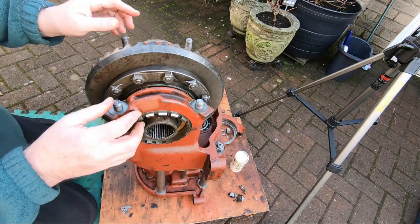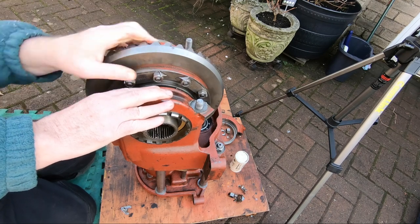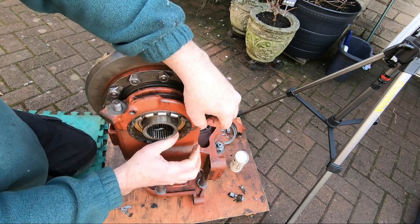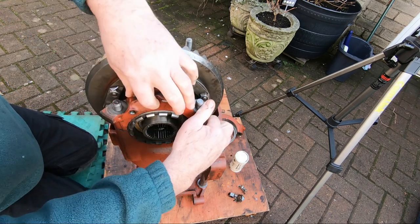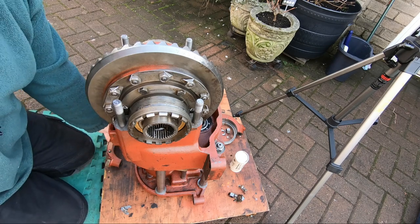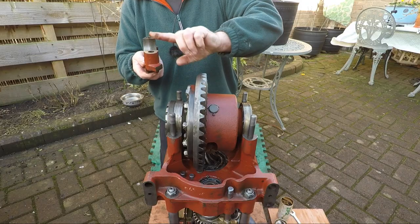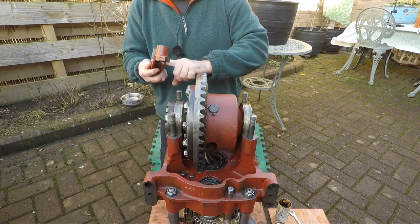Right, now. Nice rotation there. Okay, let's get this cap off. As I say, this adjustment nut will stay in the right place due to the bottom thread. Greased up. I don't want a lot on here, I just want enough to lube the threads and prevent a bit of surface rust, because again, we don't know how long this is going to sit.